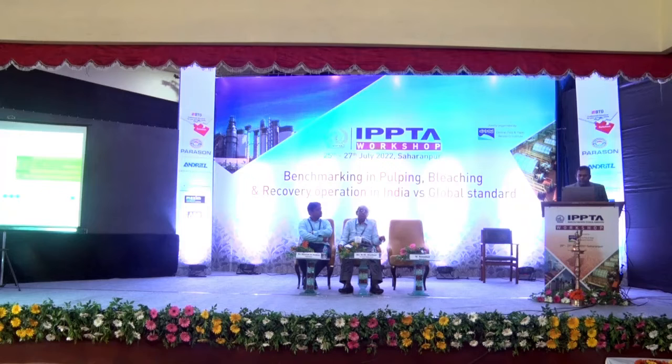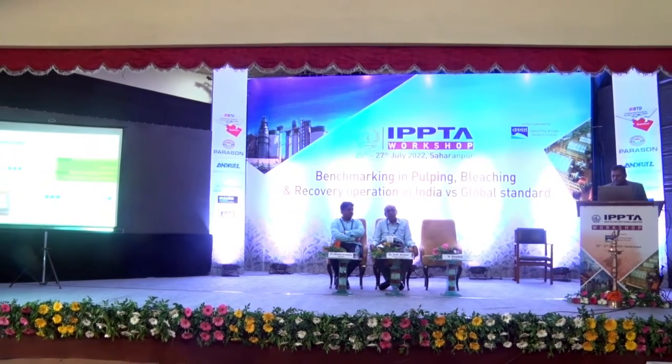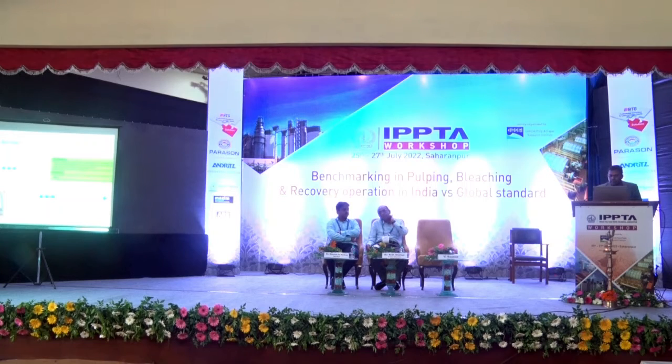Later on, because of this issue, we recommended installing a cleaning process, and we moved the screen room after the washing section. You see here at the bottom of this slide what we modified. Initially the screen room was installed first, then the wash plant. Later we modified it: before the wash plant, we introduced the sand riffler. The purpose of the sand riffler is to remove big stones and everything before taking the material to the washing equipment. Then we moved the screen room after the wash plant, and the plant was running very well.